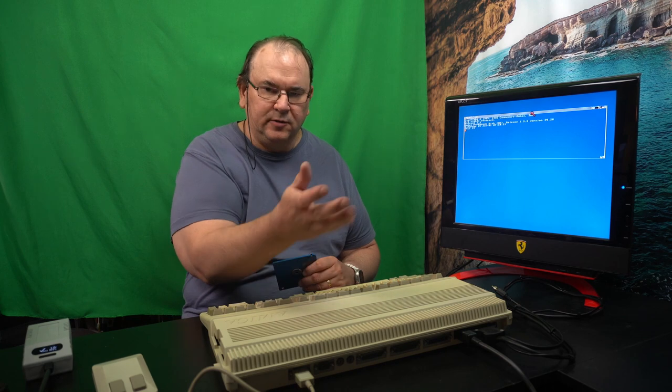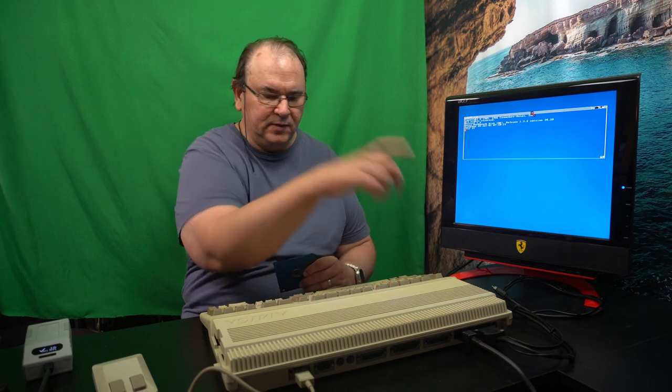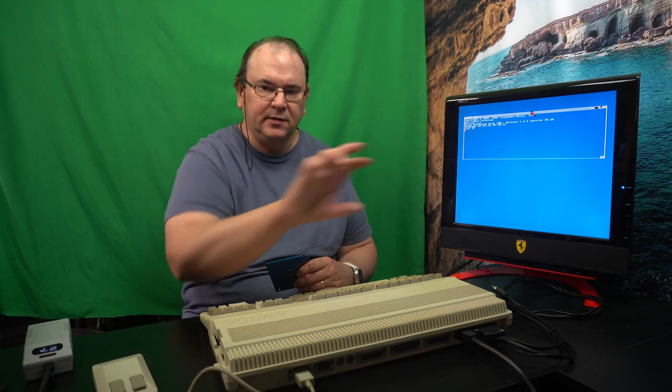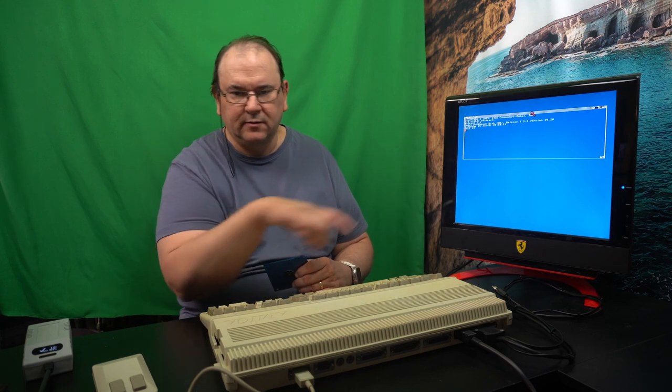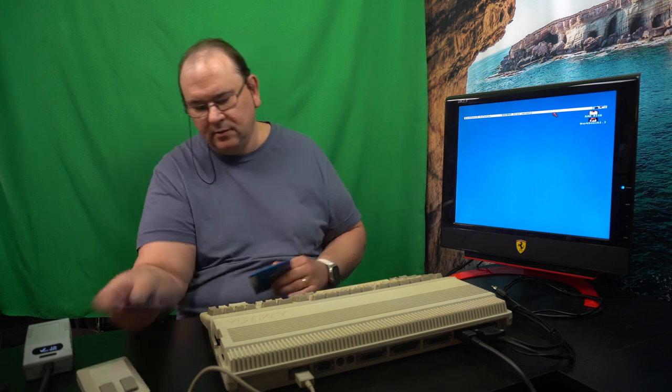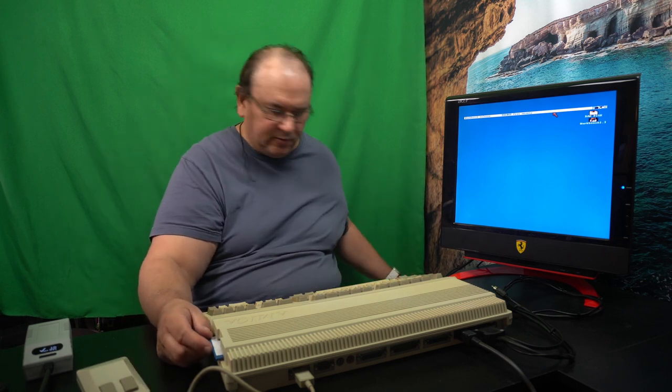And the thing is, that memory module will not sort of fall, even if this is upside down, it won't fall into the cavity, because the actual circuit board is wide enough that it actually fits on the rails that surround the cover. So mechanically, once you put the cover on, it's very solidly in place. So there's no mechanical reason not to run it without the shielding. The shielding is more for electronic interference protection back in the day. So under the EMC standards that existed 30 years ago.